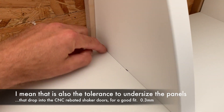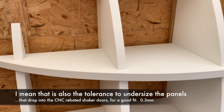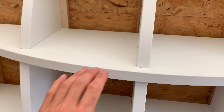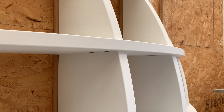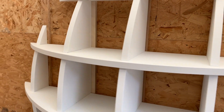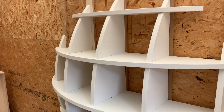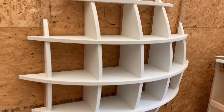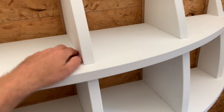I originally had in mind a bigger round-over on them, which I think is what Mr. Thorsen did. I left this for the guys to do and they made the decision to put a smaller round-over on. I came back and thought I wanted it bigger, but I hadn't communicated it that well — and it actually looks fine. The cut in this piece that slots in was cut at 25.3 millimeters to fit around the 25mm upright, and there is a bit of grab and friction. There's a little bit of misalignment within a millimetre or so, which actually adds to the friction and grab because there's nothing really mechanically holding it in place — the friction is enough.